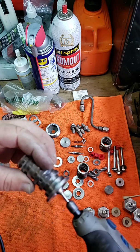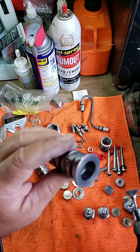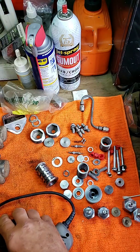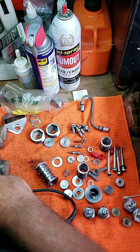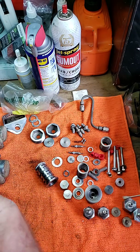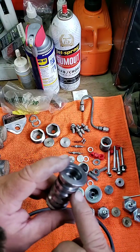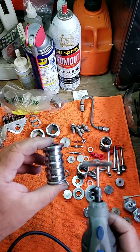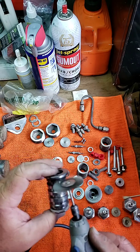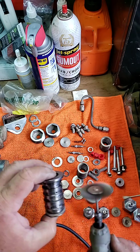So we're going to go ahead and just clean that. I've got special brushes, special cleaners and buffers to clean all of that, just like that. Look at the inside of that — like a surgeon. So when that Rolls-Royce 363 brake fluid comes, ease it on out of there. When you have all these little parts and pieces on the bench and you know where each one of them goes — that's something. And there ain't no manual here, no exploded diagram, no playbook. So you can see that little bit of gunk in there — we're going to go down each and every one of them. That's where the O-ring sits, and we want to make sure that O-ring is going to sit in there perfectly without being held up on anything.